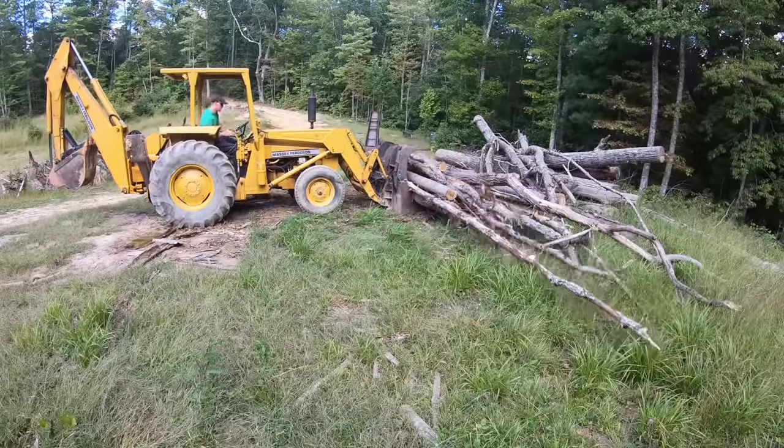One thing I am going to do, like I mentioned, is get two longer lines and two T's and move these over here, because whenever you use a grapple, it does put that at a weird twist, and I'm sure over an extended period of time, that will cause an issue. So that, and I'll hammer these out. So use the grease fittings.